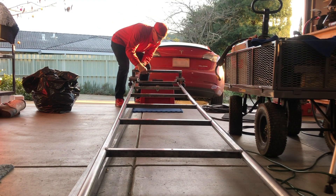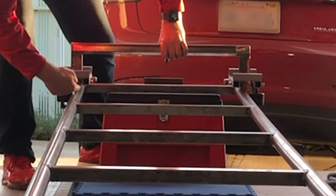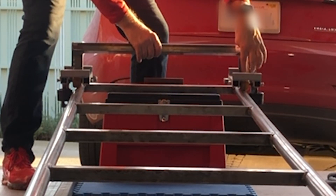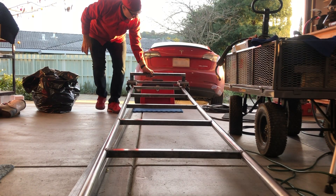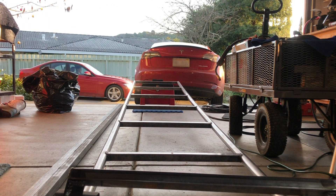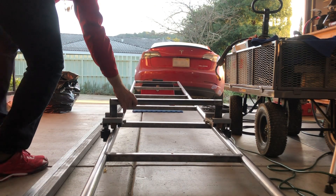Now what I want to do is prop up that piece of track on the floor and see if this thing will sit nice on the track. So here's the wheel assembly on the track — it fits really nicely. You can see that the centerline of the wheels matches really well with the centerline of the track. If I drop this it doesn't move because this piece of the wheel assembly knocks against the wheels, so it needs to be upright. But when I put on the sidestop wheels, look at how beautifully it rides. It rides really, really smooth, as you would expect a roller coaster to do.